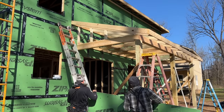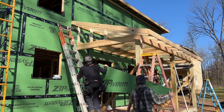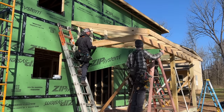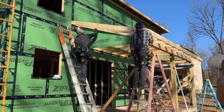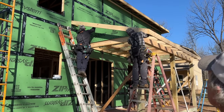We've got our little gable in framed here. We framed it flat because there's no insulation value needed right here, so that was easier — just went to the bottom of the rafter. We even ripped the R off the ZIP-R, taking the half-inch foam off, and Arlo is going to use that for something insulated.